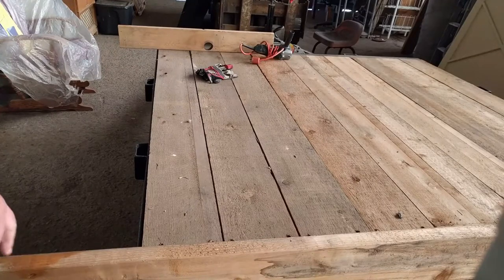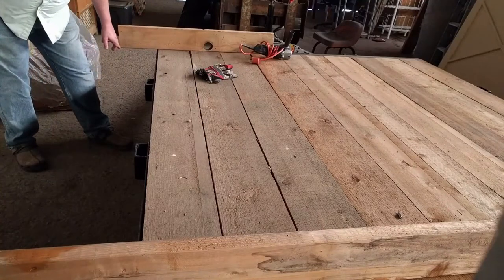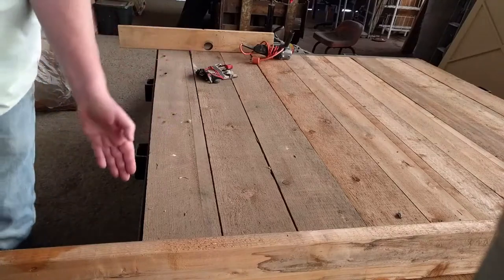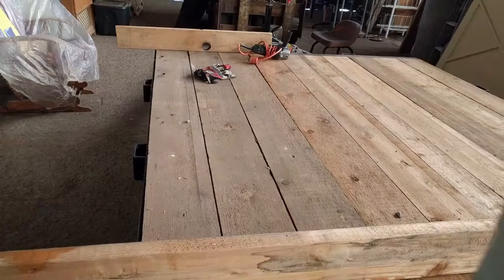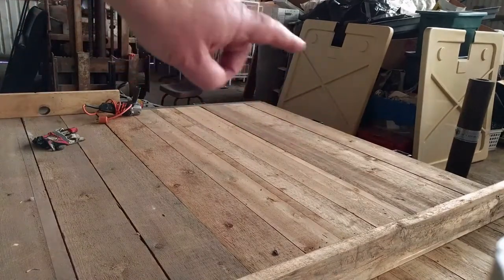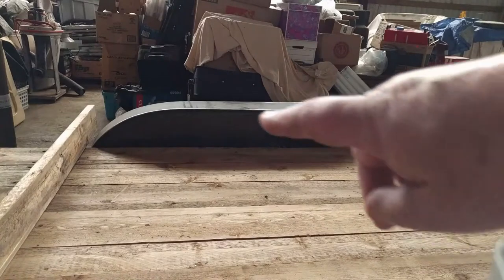I'm going to build a subfloor out of two-by-sixes and extend it out 10 inches on both sides, which will make it a complete eight feet wide, with joists every two feet. I can insulate the floor that way. It's going to raise the floor up six inches, which might affect my two-story loft idea. Instead, I could put a bunk system on one side and a single twin on the other — that still sleeps three people. We'd have a bathroom and shower on one side, a little bit of kitchen room, and a shower in the back corner.